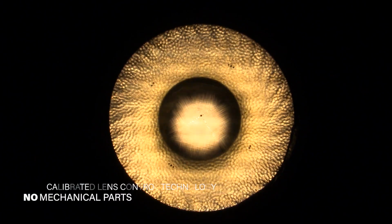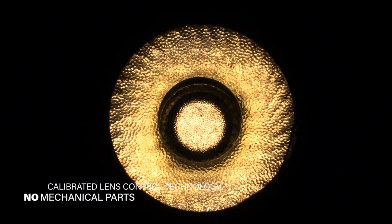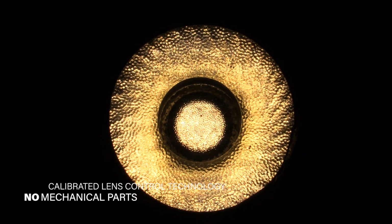The Monet includes the same liquid crystal calibrated lens control, dual RGB CCT LED lamp, and the integrated long-range antenna as the Rembrandt fixture. Monet includes high-temperature O-rings and adjustable rotating beam direction. Since area lights or path lights are used with specific intention, the Van Gogh includes a fixed-width conical lens, in addition to the dual RGB CCT LED lamp and an integrated long-range antenna.